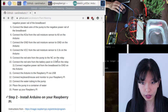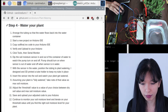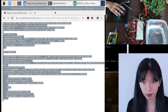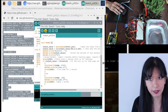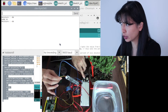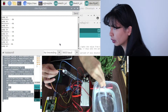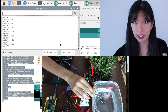Now let's check if we can tie in the pump. Start a new project, copy the code from soil_final.ino in the repository, hit Raw, copy everything, start a new sketch, paste, and upload to the Arduino. Open Tools > Serial Monitor. With my switch I can control the pump manually — when I turn it on you can see the water coming out, recycling within the container. When I put the capacitive sensor in the water, the pump turns off. We've verified the pump works.